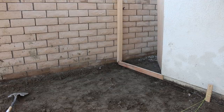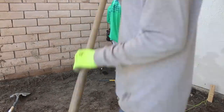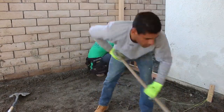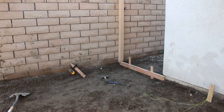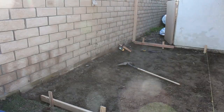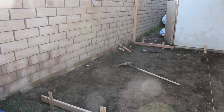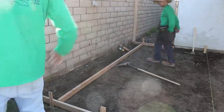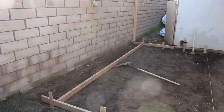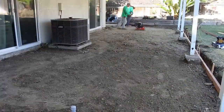That's the little wall I was talking about — you can see the red chalk line I snapped against it. That's how close it was to the foundation. The red chalk line is level with the weep screed — actually a half inch down from the weep screed. You can see I'm getting ready to put that form in right now, and once we have our grade set, we'll move forward.